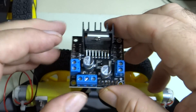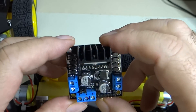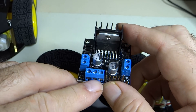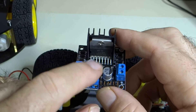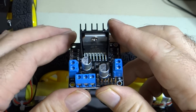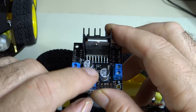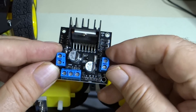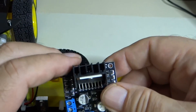The power for the motors from the batteries comes in here, and we'll be wiring that up later. So the batteries will connect here, and that power from the batteries will go to the FETs. These control pins turn the FETs on and off depending on which way you want to go and how fast. The electricity to the motors then comes out from these two pins here. So we're going to mount this down.